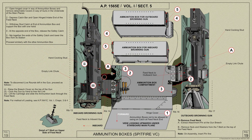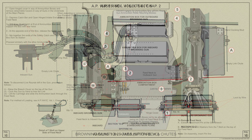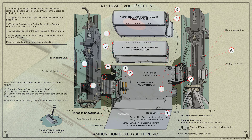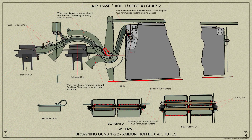The Browning gun mountings are similar to those fitted on the Spitfire 5A and B. The two outboard guns in each 5C plane are similarly arranged, except that the inner gun of the two has been moved outboard to the extent of one rib bay. The two inboard guns are mounted in the same bases as those used for the Hispano guns, the mountings being interchangeable. The ammunition boxes for the two outboard Browning guns in each plane are arranged just like those of the Spitfires 5A and B, those for the inboard guns being mounted together as a unit in the Hispano gun forward ammunition box. These are filled in position in the main plane after removing the cover on the top surface, each section taking 630 rounds. Feed necks lead the ammunition to each gun, that for the inboard gun arching over the outboard gun.